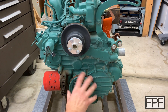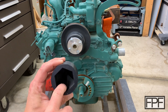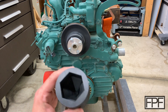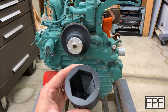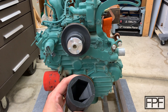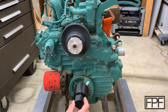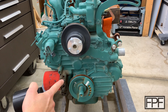I don't want to take this nut off — I'm just trying to turn this pulley. So what I did is I 3D printed a 46 millimeter socket: it's 46 millimeters on the inside and on the outside, so I can drive it with just a regular 46 millimeter real socket. You can see it's quite deep — it actually goes down into a sort of pyramid shape for strength, but also because this is printed in this position on the bed. By having that pyramid shape going up inside, I only have a small bridge at the bottom of the socket. And we can see this easily goes on here and engages that hex, so it's my hope that I can spin this motor over by hand and see if it's locked up.